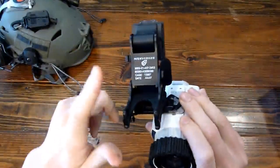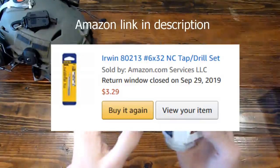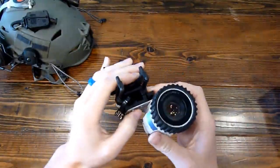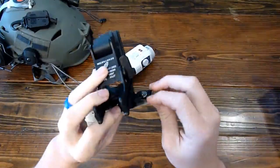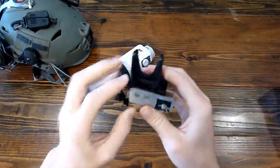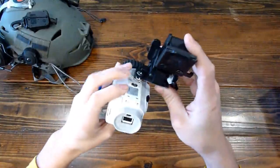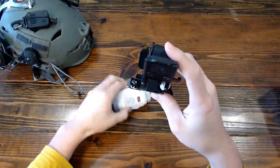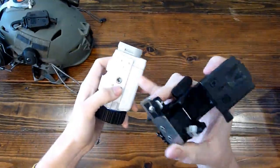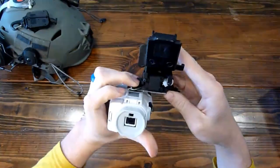As far as attaching the rhino mount, it's actually pretty simple. You can get a drill and tap set off of eBay or Amazon, and some machine screws — I already had both of those for a different project. All you have to do is mark the holes, drill holes through your piece of metal. This is a piece of 1/16-inch D2 tool steel, but you can use lots of different stuff. Drill through, tap them, countersink, and put your machine screws through to attach this. You're going to hold it left and right, see where you want it, make a mark, and drill a hole where you can put this quarter-twenty bolt through. That's the same thread used for the camera mounts on the bottom of basically all cameras — that way you can mount it on the bottom and have it be right where you need it.